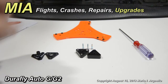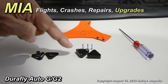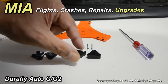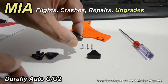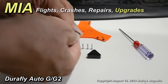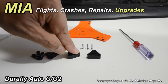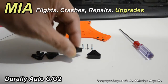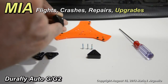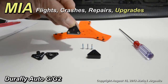These nuts have been already installed into one of the plates, but they come as individual pieces. What you need to do with each nut is take it and insert it into the pocket. These have pockets, and this is a press fit. Simply take the nut and press fit it carefully over a flat surface. Repeat the same thing with the other nuts — they seat almost halfway into this part.